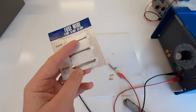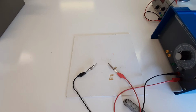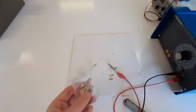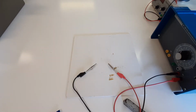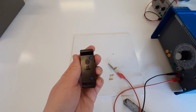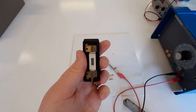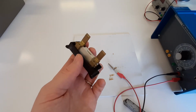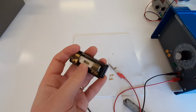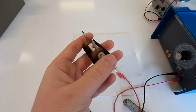Now, obviously, something like this is a bit dangerous to be having dangling around inside a circuit. So the modern solution is to wrap it up inside one of these tubes. And then when that's busted, you just throw it away. In the old days, they used to use these things, which used to be the old equivalent of a circuit breaker. See, this is a 15 amp one, and it's basically got a tiny bit of fuse wire inside this thing, in between two fairly chunky contacts, and there you go. When this thing blows and melts, you're going to reattach a fuse wire inside.